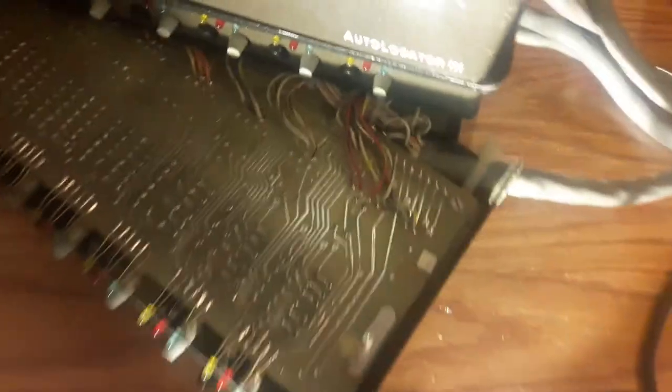The only other thing — I checked the traces on the circuit board, it's a direct connection. I popped this open and there's a lead just not even attached, just broke off the solder right at the very end. So yeah, gonna resolder that and be back in business.